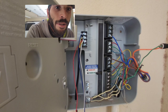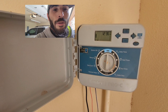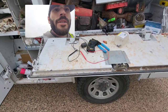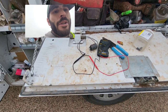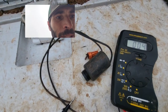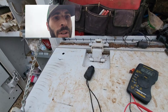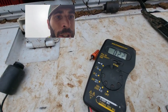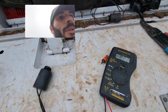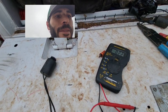The error on zone 9 is because of the add-a-zone, so I'm not too worried. I may double check that one since it was working a second ago. But this is a very easy way to check using just a screwdriver — and some wire cutters. In case you're wondering how I knew the solenoid was faulty: we checked with a multimeter. The old solenoid was showing an ohms reading of 4, while a brand new solenoid shows 22 ohms. So we knew the old solenoid was shorted. Throw it away, put a brand new one in — nice and easy.